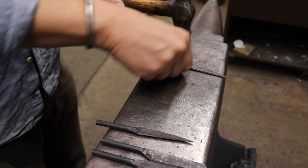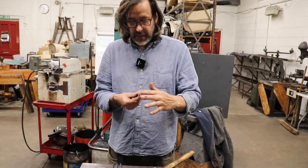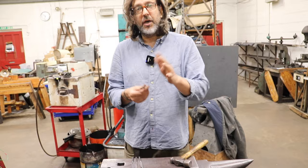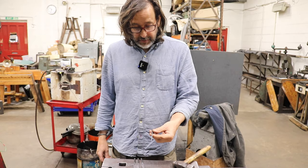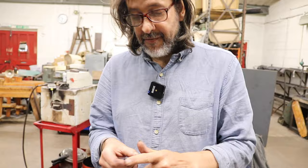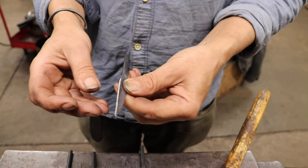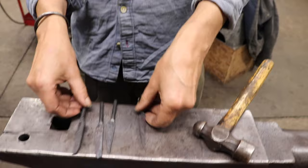That's it, and it doesn't really matter because after grinding I'll be checking for straightness again. But it's difficult to grind because it's no fun trying to grind a banana, you don't get an idea what's straight. So I'm going to do the tiniest bit of grinding at this point, just in case. When kids cut paper with scissors, you get these jagged edges. They're really nasty in steel if you get that. There's a little tag here which, you see, my finger will catch on horrendously. So I just want to run over it with a grinder and buzz those off. So that's the next stage.